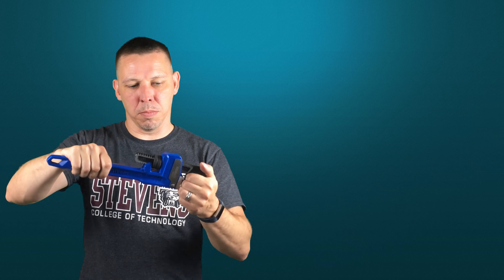With soft pipe there's a pinching action where it binds, but you're just mangling it — you're crushing or pinching the pipe completely shut, especially with copper or small tubing. With stainless steel tubing, not only are you going to destroy it, but you're also not going to get a good grab because the finish on stainless is really smooth and the teeth can't grab. The wrench will just slip around, and if you do grab it, chances are you'll pinch the tubing shut or bend it badly. These are designed for heavy pieces of pipe that can withstand the grabbing action.